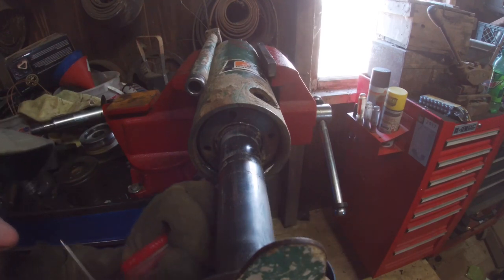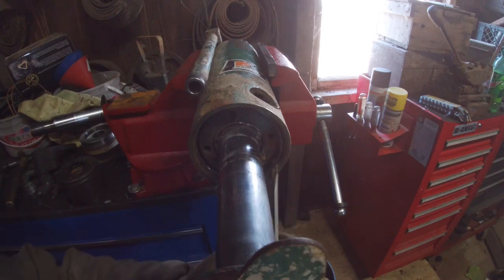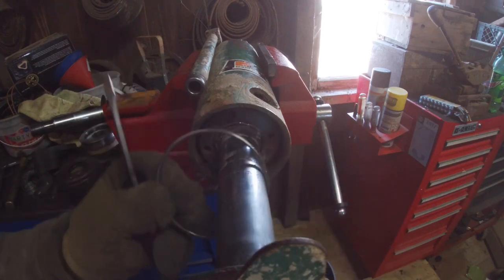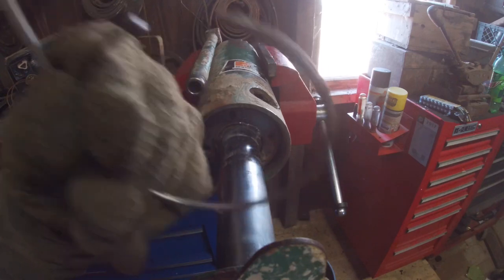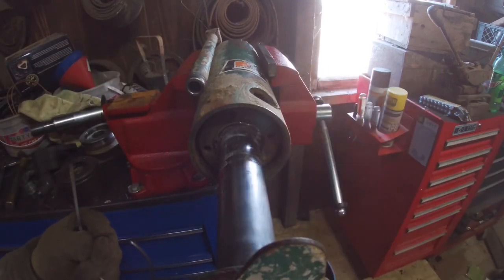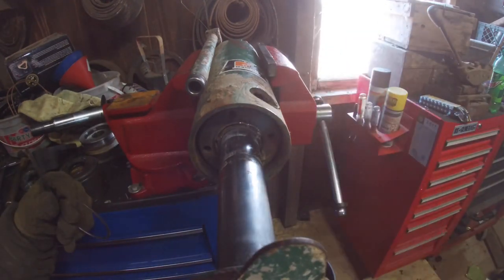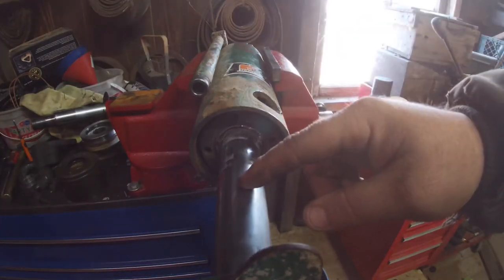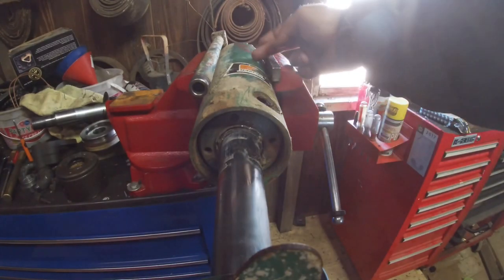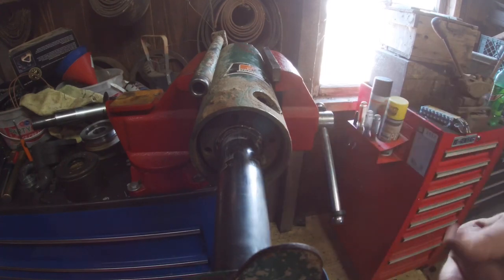Our snap ring — or lock ring, or whatever you want to call it — is going to probably require patience. It's just a round piece of wire and it holds this from coming any farther out. The bolted piece that we took off holds this from going back in, so they work together and hold the head at the end of the barrel there. Now what we're going to do is use this as a slide hammer because on the end of this rod is a piston, and we're going to pull it against the head end so we can pull the head end out of the barrel and then continue on.